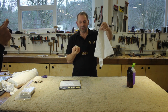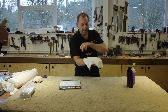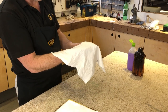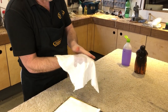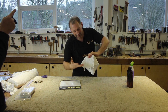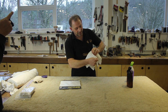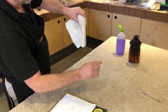Now here's the cotton cloth that creates the rubber. This one's about 12 inches each side. I'm going to lay it on the face at an angle — a point to the corner, doesn't matter which corner. One corner is up on my arm and the other corner is pointing away. I'm going to put a little bit of meths because this is a brand new rubber. My hands are sticky with the polish — I want to be able to grab hold of that fad underneath. I'm placing it into my left hand, which frees up my right, then I'm going to pull down and pull underneath, fold another section of the cloth underneath. There's a flat edge to the rubber and there should be a point forming down here.